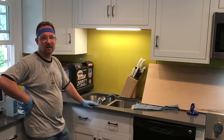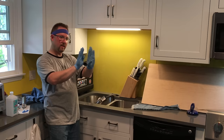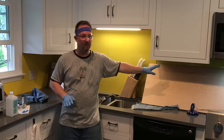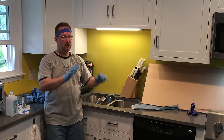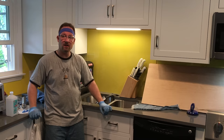We have this, like we figured might happen, the middle piece and the piece that goes behind the stove are different heights. They're different depths away from the wall because there's clearly a big high spot, a bump right here in the middle of this wall. And then the other wall over there does not, or it's just shaped a little differently. All being out of square, it seems like it slopes away from the glass right behind the stove, but it's tight to the glass closer here. So there's not much you can do about that unless you really wanted to shim it up and test fit it a bunch of times. And we just didn't think that was completely necessary for the quality of the job that we needed to do. We like it nice, but this has been a long time coming. We just want to get this done to have our kitchen officially finished.